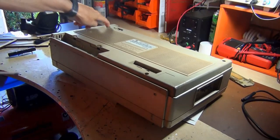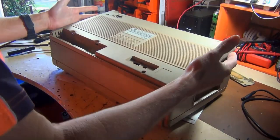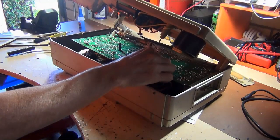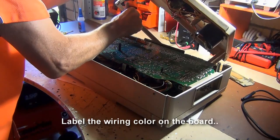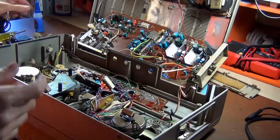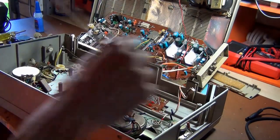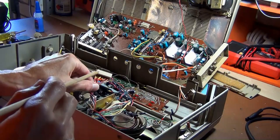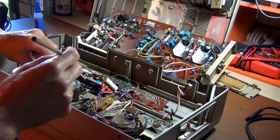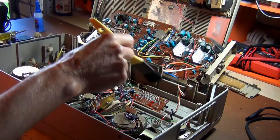You're missing a screw in the top left-hand section, so somebody's definitely been in here and I suspect changed the belt. Inside the battery compartment there are two screws that have to come out as well. Take off the back part here — you'll have wires for the external FM antenna, three wires at the top, and power adapter wires. Looking at the back of the board, I'm going to give it a clean then remove it. Take off the round dials at the top with a screwdriver. Nine or ten screws hold the board in. Disconnect the connectors and the microphone. Belt looks in really good condition — somebody has replaced it. The string is actually off on a roller here, and also off this roller here, but the actual string is not broken, so that's a good thing.